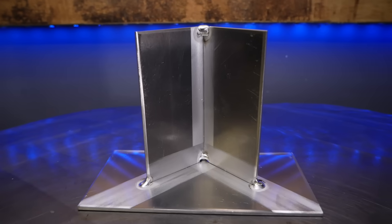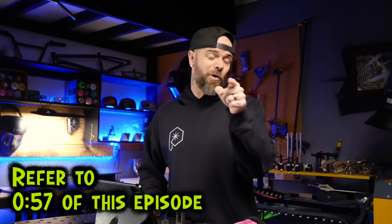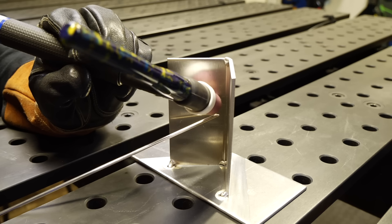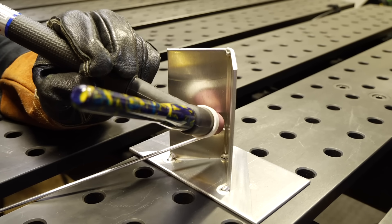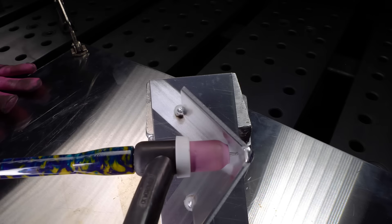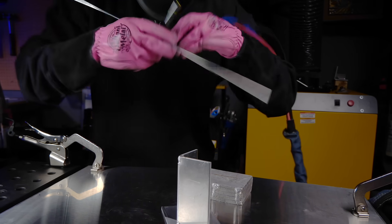Once assembled properly, let's get comfortable and check off the biggest problems we talked about earlier. I need to be able to see and travel comfortably. Heading away from a corner is definitely going to help with this. Traveling vertical down towards the corner is more challenging for consistency, and feeding material heading vertically down is very challenging. Flashing up and looking at my starting point in the pocket, I'm actually pretty light on filler material — using too much can create an obstacle to deal with later. Using a little less filler along with good heat lets the edges blend in nice and smooth.